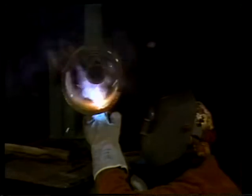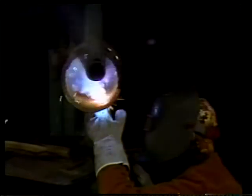This is the shielded metal method of arc welding that we talked about earlier. We saw that the electrode was consumed during the welding process and that the coating on it forms a protective shield against contamination by the surrounding air.